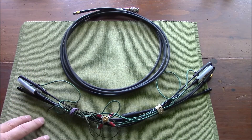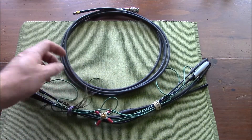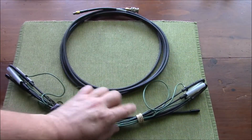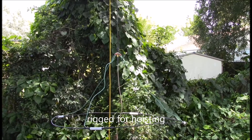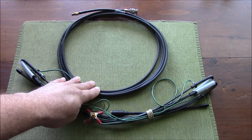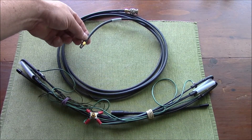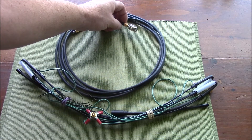This is my version 1.0 folding ground plane — there's a video on it in the description box. It's a very simple design using basic hookup wire, with HT antennas for the resonator and an SMA pass-through. The RF cable is 15 feet of RG223 with SMA connectors, and I added an adapter on either end so I could use a radio with a male SMA, a female SMA, or a BNC connector.